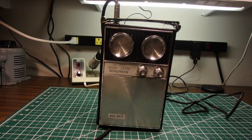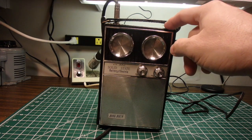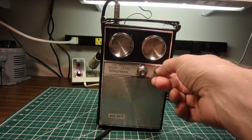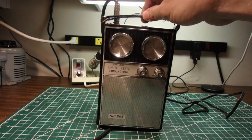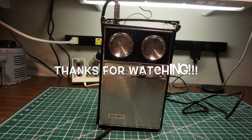A nice little practice amplifier made from an old transistor radio. With the preamp added, we have better impedance matching from the guitar to the transistor radio, which also means you can use high-impedance pickups like piezo pickups on a cigar box guitar, and safely put guitar pedals on the front end. It's a great little practice amp, and with a nine-volt battery strapped to your guitar strap it makes a nice busking amp as well. I hope you enjoyed it — thanks for watching.